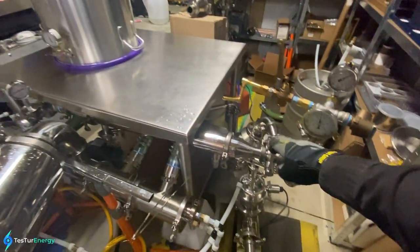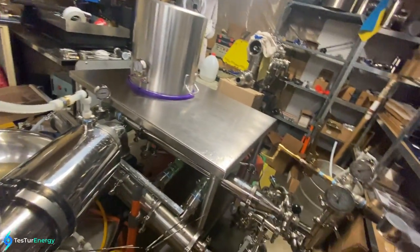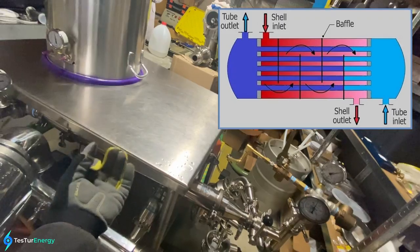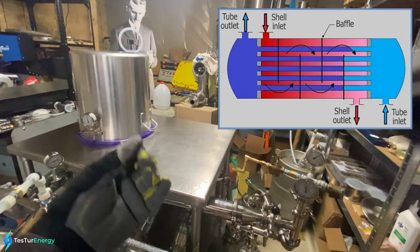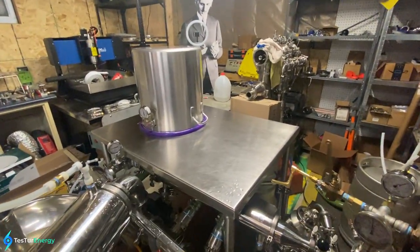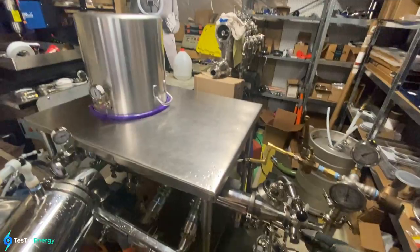The shell of the superheater is just a steam header in the boiler. When you open the throttle it will depressurize gas into the superheater, so the pressure of the steam in the superheater tubes will always be lower than in the boiler shell. That means the temperature in the shell will always be higher than the boiling point in the tubes. It's not a really good heat exchange, but it's better than nothing.